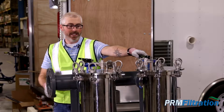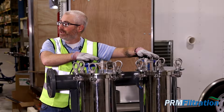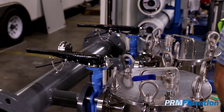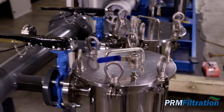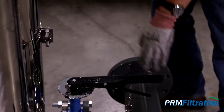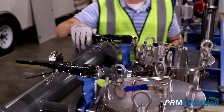A couple of features: you have your valves on the influent at the top, and coming around to the effluent — again it's another manifold — you have your effluent gauge and two valves to control the flow through each vessel. The great thing with the dual filter skid is that it allows you to continue operations even if you need to change out a bag filter.